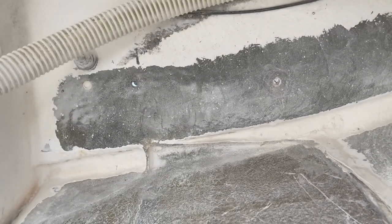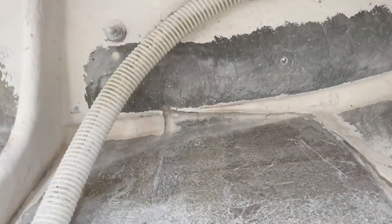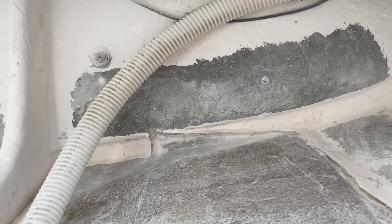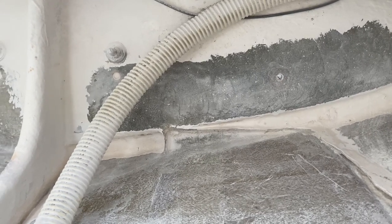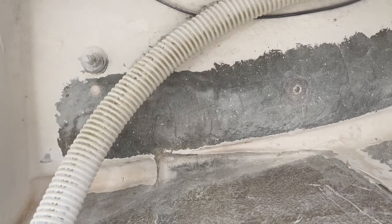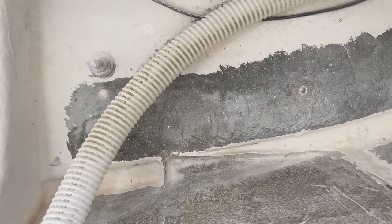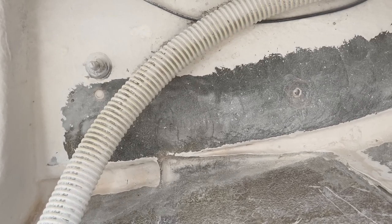There's two wells there for the old outboard but there were two, now there's only one. Speed-wise it had twin 40s on it years and years ago and now it's got a single outboard — and that's the same speed, because on a single monohull boat like this one there ain't got enough width to separate them, not like a cat; you share the water too much. But we always leave those holes in the back because if you ever want to do work on the keel shoe or the keel bands, we use those holes to bolt stilts in so you can keep the bow off the floor.